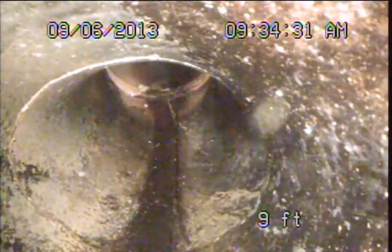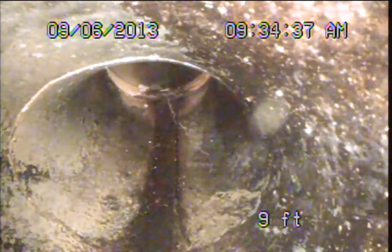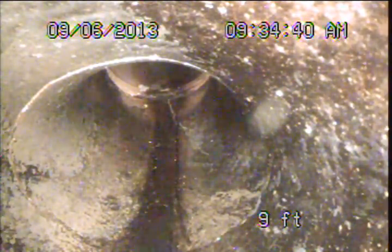You'll see here we drop down steeply for a few feet. Commonly when you get a crack at the top and things actually start to break or damage, you're going to start seeing cracks here along the bottom as well. So at some point we'll probably be discussing replacing this drop area, but for the time being it doesn't seem to be really affecting the overall function of the system. As we level back out, we're dropping into the six-inch pipe that's going to carry us out to the public sewer under the street. We're seeing the beginnings of some very minor root intrusions through this pipe, but nothing of any real significance or anything that would even dictate recommending a cleaning.